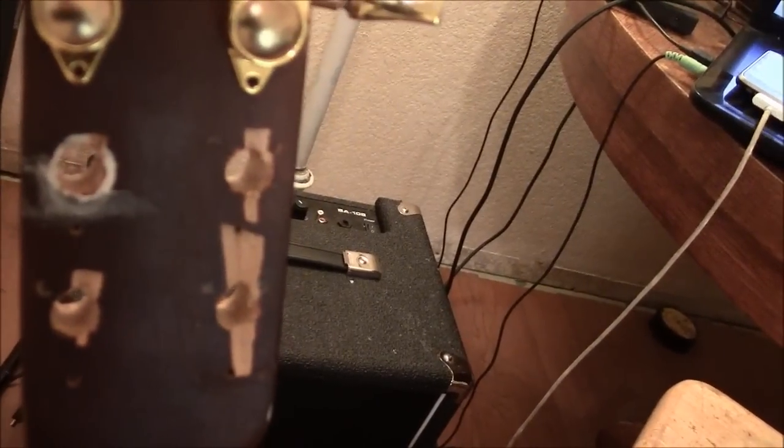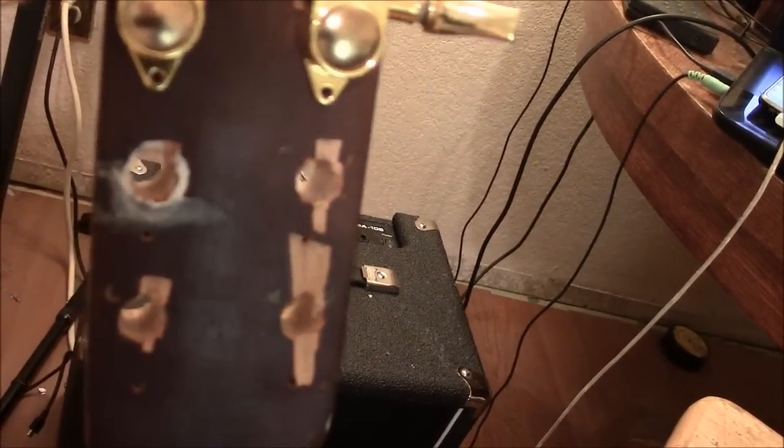Like I said, guys, if you're going to drill out the back of these things, or actually route out the holes on these things with an awl, if there's any question about them chipping, like on an old guitar, always be sure to score a complete circle around that so that it doesn't chip. If I take an X-Acto knife, right? Let me show you.